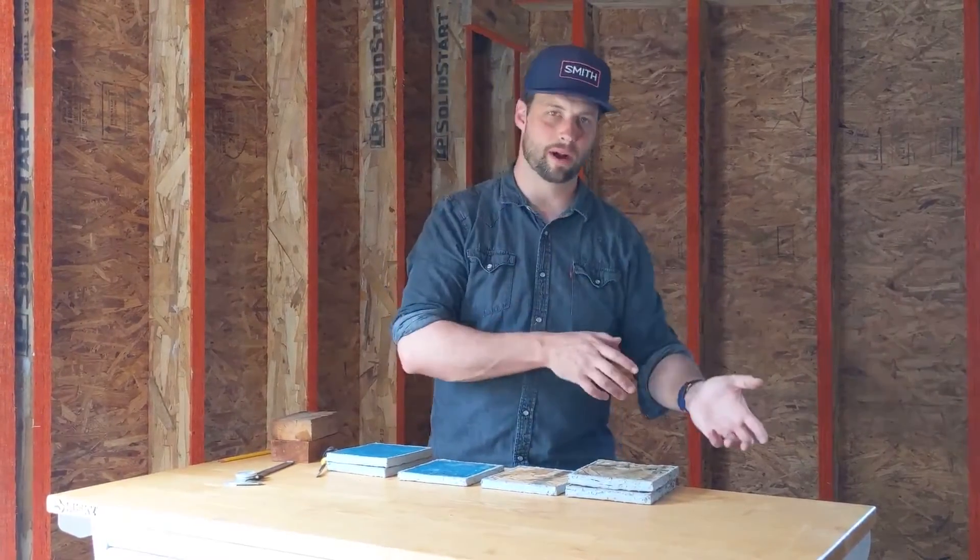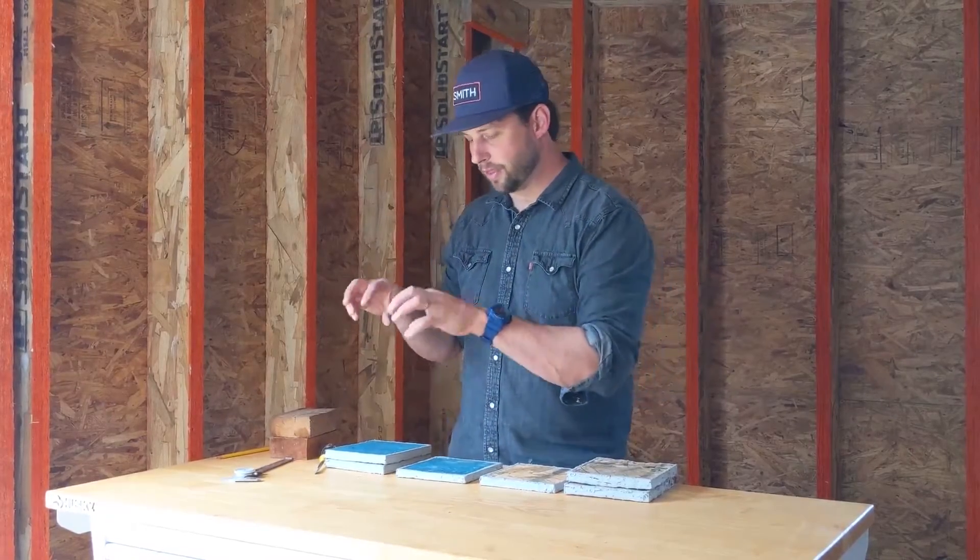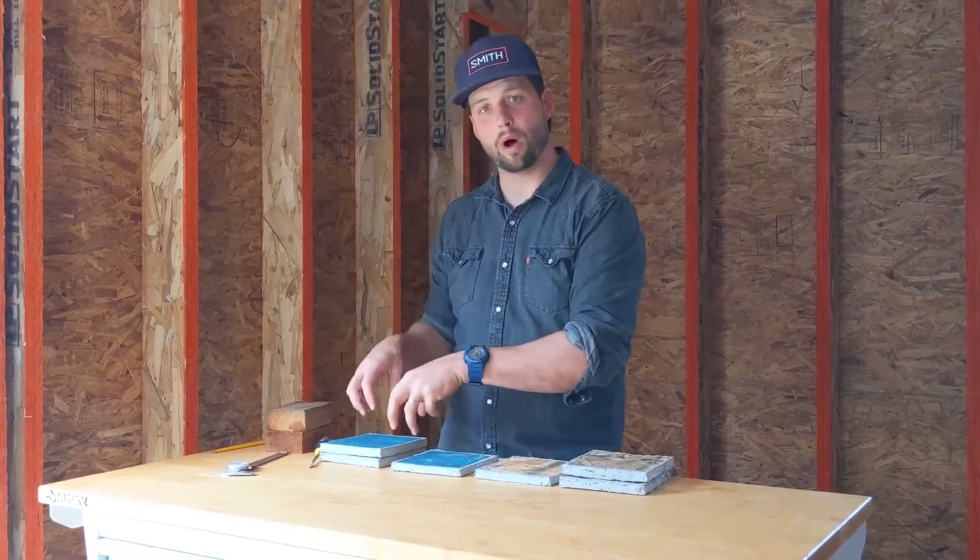I did 10 cycles: 24 hours in the water, freezing, 24 hours in the water, freezing — back and forth 10 times. The WeatherLogic expanded 18%, so it let some water through.